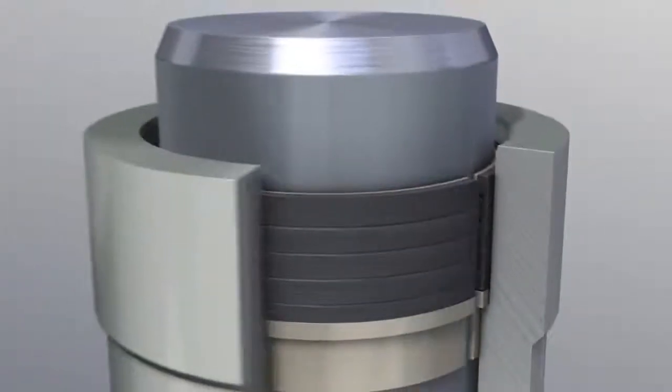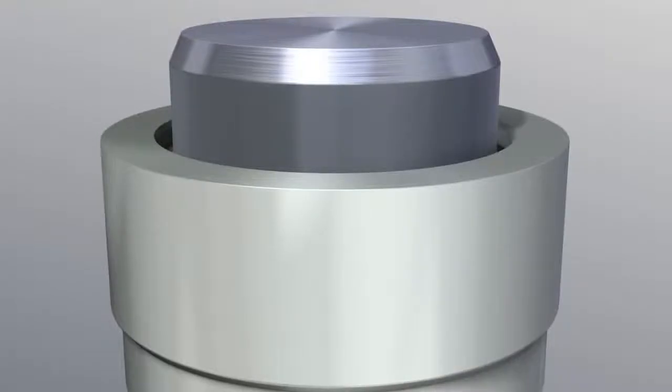For correct initial tension of the V-packing set in the housing, the tension should be as low as possible while maintaining leak-free operation. If the preset height according to the L measurement results in leakage, remove the thin gland shims one by one until leakage ceases. Proceed in small steps. If the initial tension is chosen too high, the resulting generation of high temperatures may lead to premature wear of the packing set.